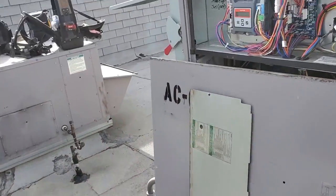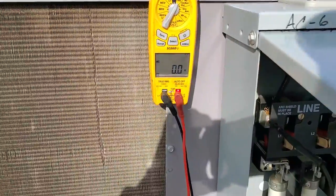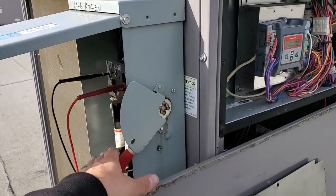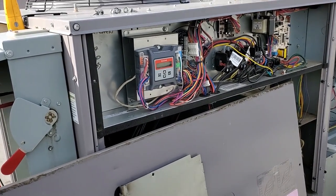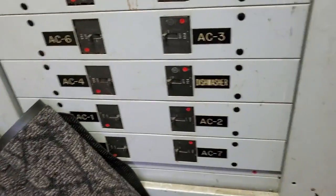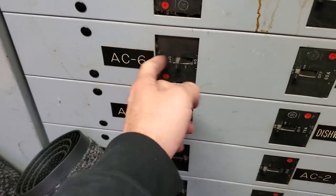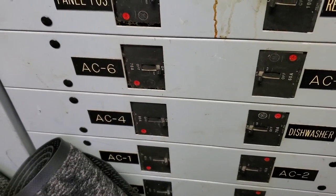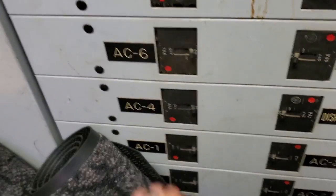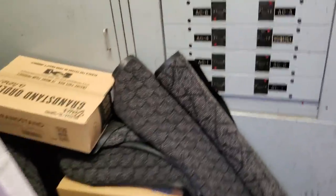The unit has no power on the Jade controller. Coming over to the disconnect switch — we've got no power there either. I've got to go downstairs and find the main power breaker. We turn the disconnect off, go downstairs, find the breaker, turn it on whether it's tripped or not, then come up and diagnose. The breaker was not tripped — it was just off. They might've rubbed up against it with their stuff.